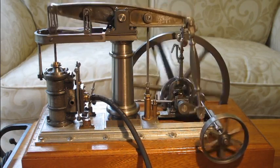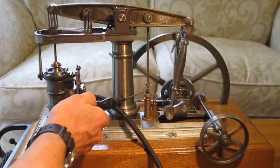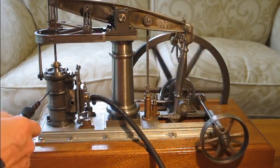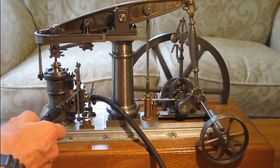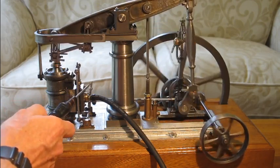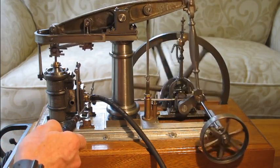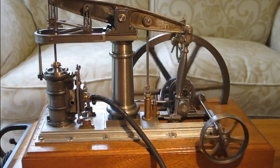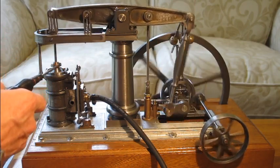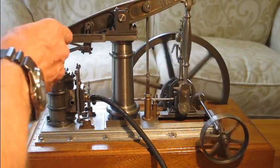The various components of the engine — primarily these engines were designed to pump water out of mines, and the pump is here. I haven't finished the pump completely but there's got to be a pipe coming in from here which loops around. This end is the cylinder and this is the valve system here. As the valve comes up it allows air — or in the real case steam — to go on top of the cylinder and force the piston down. Conversely when the valve is at the bottom it allows air and steam underneath the cylinder to push the thing back up. Here is the parallel motion mechanism.